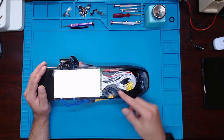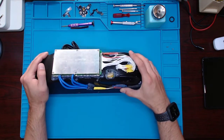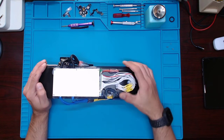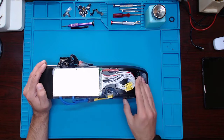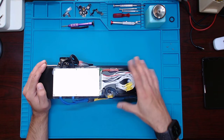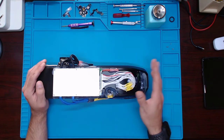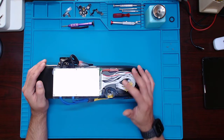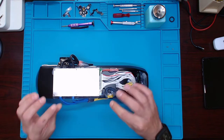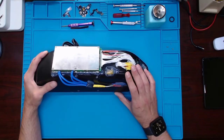I also didn't like using the battery supply that had a battery pack on the side with a button to jump-start it. It felt unsafe because the wiring was going inside — a positive and negative in there — and if it pinched inside it could cause a short or even a fire. So I just wanted to be a bit safer, and I did all the group wiring with hot glue to raise it up so the case can't jar up and damage anything.